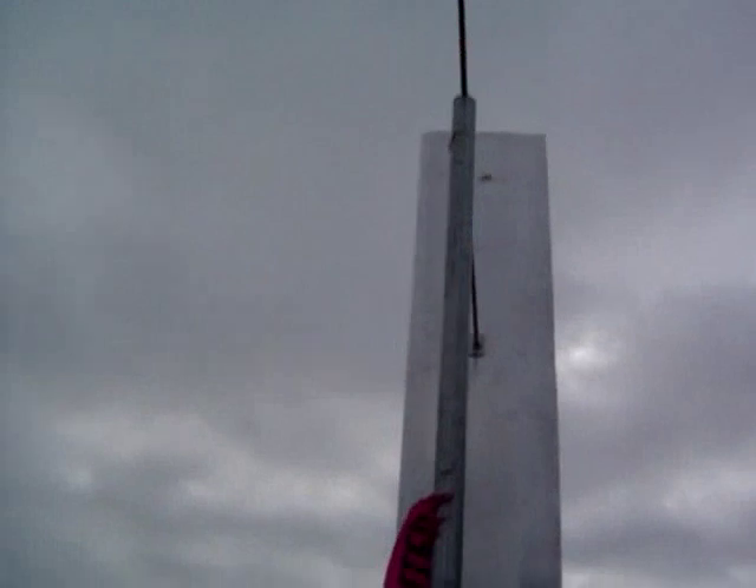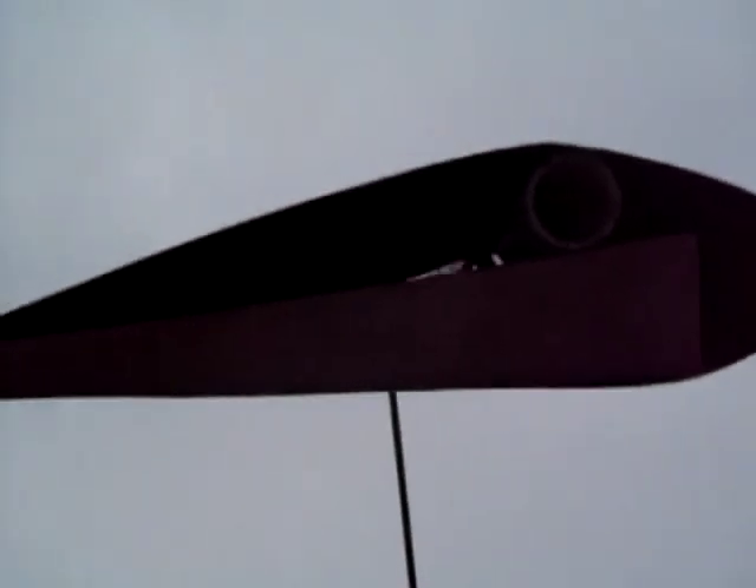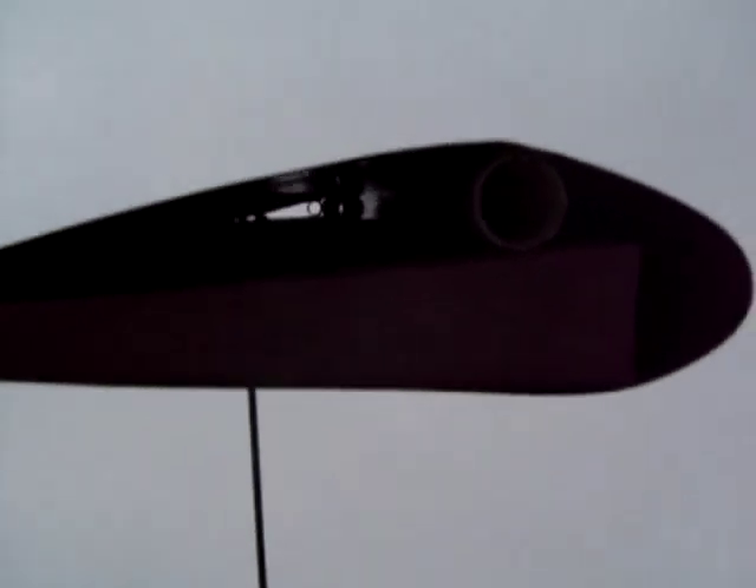That gives me an opportunity to show you how I made these blades. I don't know if the camera is going to show it, but if you look up, you can see right through — they're hollow inside to a certain degree. There's a foam core with the aluminum skin. And then I've got these tubes that I can move; I can move it backwards if I want to change this airfoil. The front of it I formed by putting the tube in here to begin with and bending the sheet over it. So I've got both of the airfoils bent over one eighth tube, and then I've got these one inch tubes inserted here — I can roll them backwards or forwards wherever I want to change the airfoil.